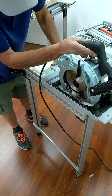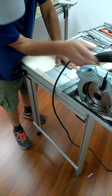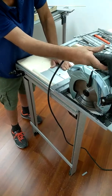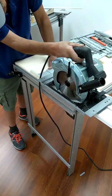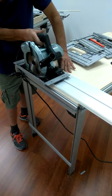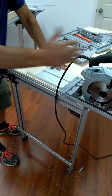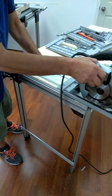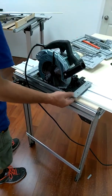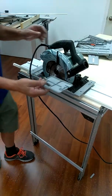I'm just resetting my guide because I don't have the space to start all over again. I'm pushing my edge. If I have a larger table, then I don't have to stop. When I restart my cut, it's fine right here — I don't want this blade to touch anything. I suggest you have a long table or long piece of wood to do that.